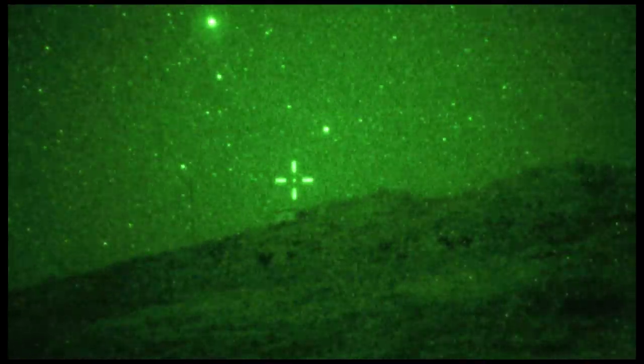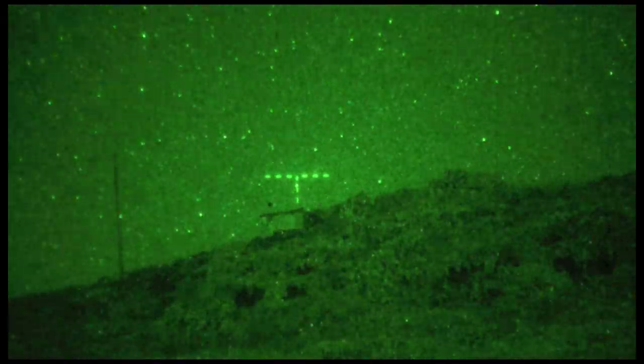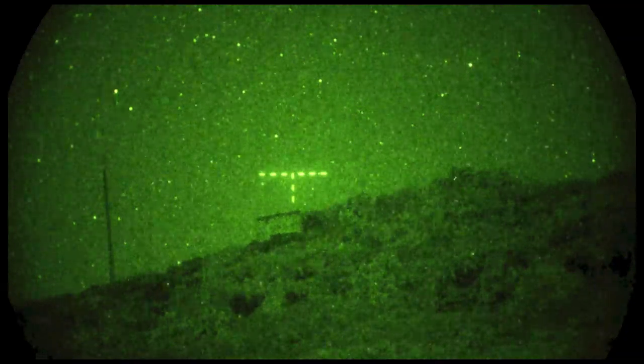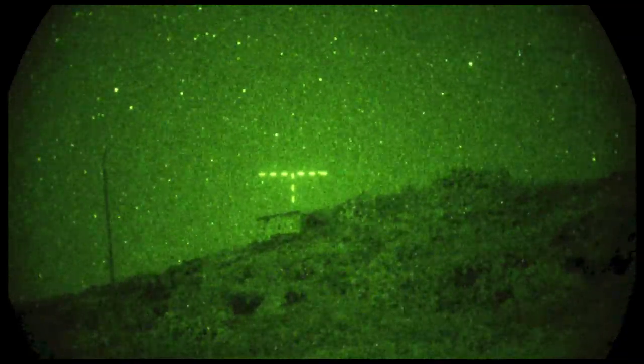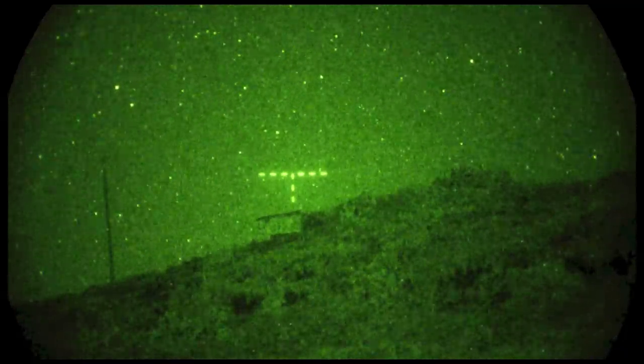These were taken approximately 10 minutes apart — the time it took to pull one tube and install the other. This is an unfinished section that was supposed to feature the TVS-5. Shown here are: a TVS-5 with a Gen 2 ESI image intensifier, a TVS-5 with a fiber optic input Gen 3 MX-11-620 image intensifier, a glass input Gen 3 25mm image intensifier in the TVS-5, and an F9800K 18mm image intensifier — giving a real opportunity to see the difference between an 18mm and 25mm format tube with the same lens system.